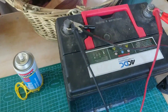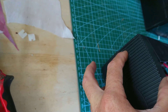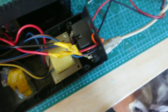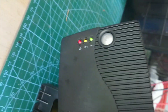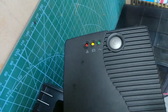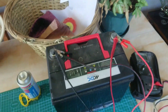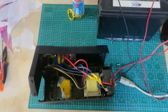So that's the cheap UPS hack. I've connected it up to the big battery going straight through here, no batteries inside. Turn it on — there we go, it's working. Unplug the back to simulate a load shed — it switches onto battery mode and will last a long time with a bigger battery. Just a nice little backup system.